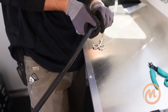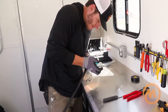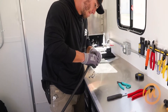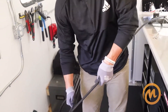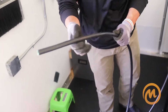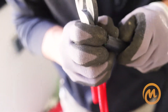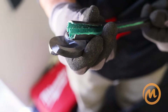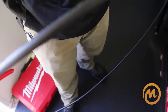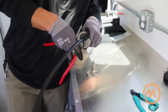If you're curious what it looks like inside the jacket and armor, there you go. We got kind of lucky — they're all different — so this one wasn't filled with glue, and we were able to peel this off in one piece. Then we do the same thing; like I said, this is double armor, so you make your score at the base, come to the top of the cable, and do the same thing about a foot back.